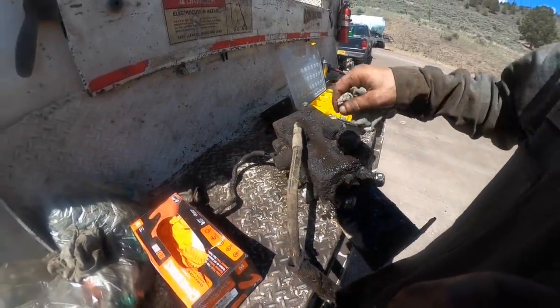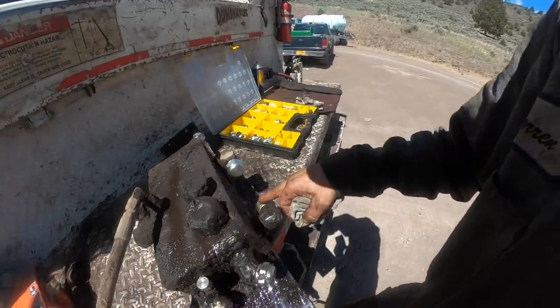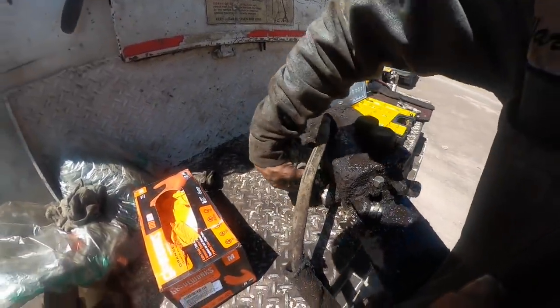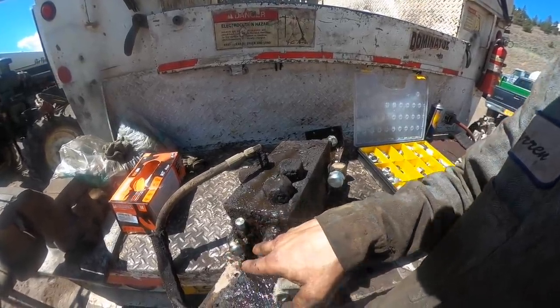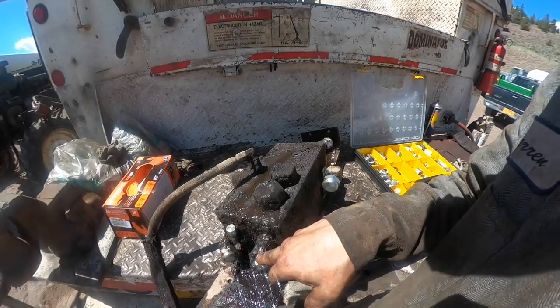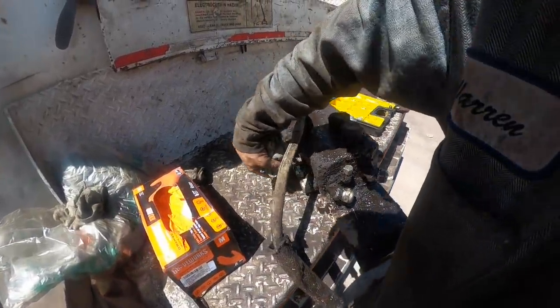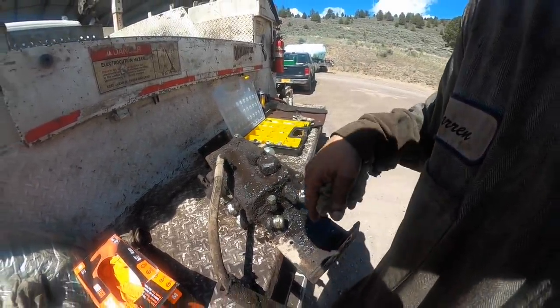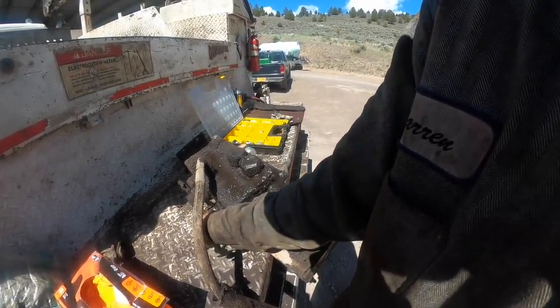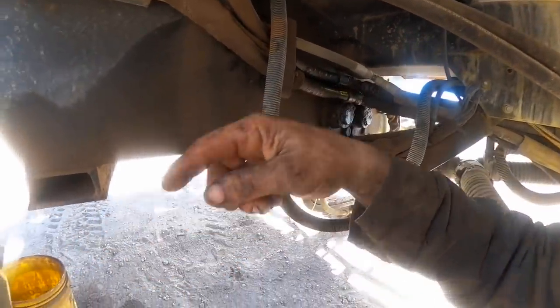But back to what I was saying, here's your shift valve coil and cartridge valve right here. Okay, here's the inlets coming from the piston pump. Here are the outlets. Okay, what they did here is, this would be the left side. Actually, I'm backwards. This is the right side. So this is going to the right front motor. These two hoses here, these two going to the left front motor. Now what they did is, instead of making a separate port for each one here, you're going to have a forward and reverse hose, and they ran them back here and teed them right here into these motors.